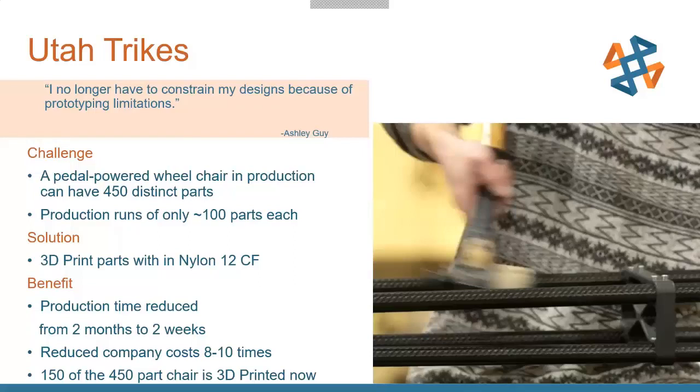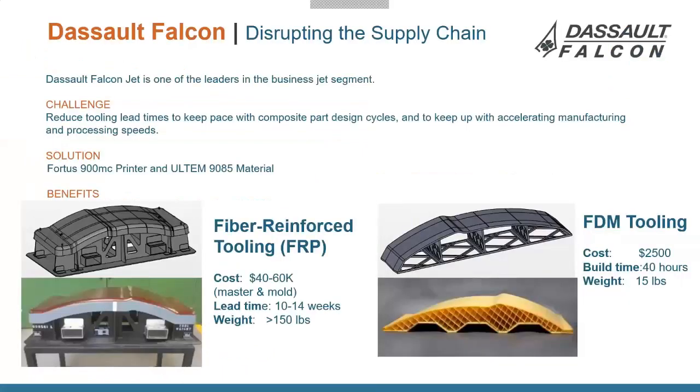The parts are very strong and durable, holding up to all the abuse required. It's a great alternative to machining other types of plastics or making injection molding tooling for low-volume runs. Another option is printing parts to replace tooling — instead of making a giant jig for fiberglass layups, you can 3D print that entire jig. There are big advantages in cost, time savings, and weight savings.